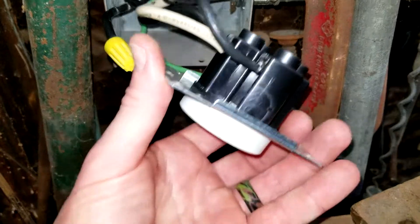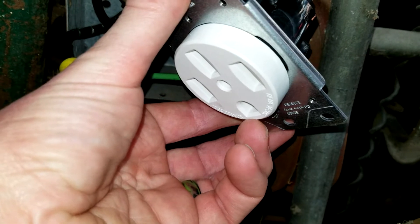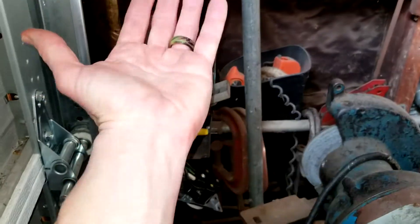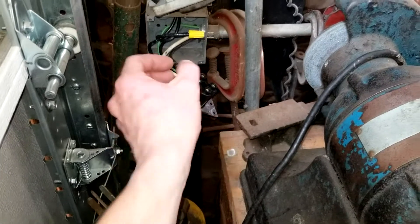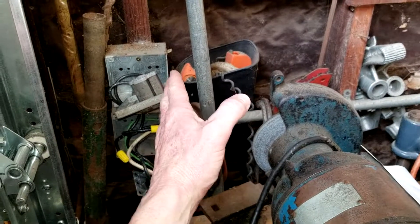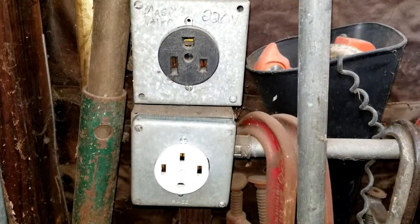We're going to go ahead and screw this one back in. Something to keep in mind is the way you orient it. My electric car charger needs the ground down at the bottom because the cord length is only about a foot. The way we're going to mount it is on one of these beams here so I need the ground facing that direction. If the outlet is higher up and you want your electric charger mounted down here, know the cord length so it's not plugged in and looped really tight — it should be nice free-hanging wire.